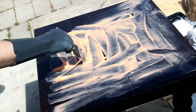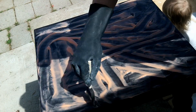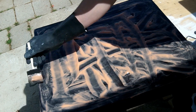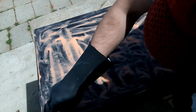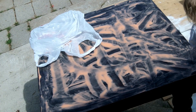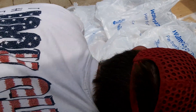This stuff when you put it on can dry quite quickly, especially in a hot climate, and when it dries it becomes really hard to get off — it becomes extremely sticky. We really enjoy using this product; it allows us to get a lot of the finish, sealer, paint, and anything else stuck onto your furniture off. To keep it from drying, something we saw on another YouTube channel is just putting plastic over it, which helps keep it from evaporating. So I'm going to cinch this all down with some painter's tape and hopefully none of the bags blow away.